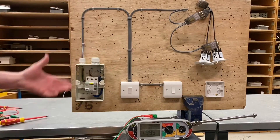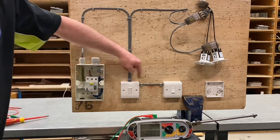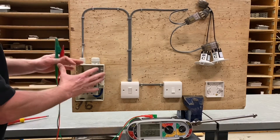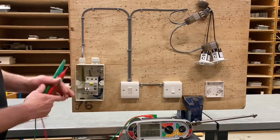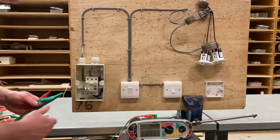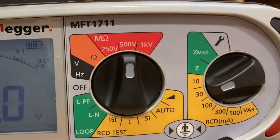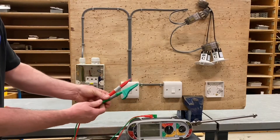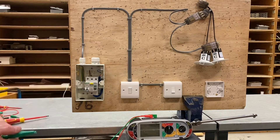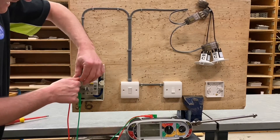We don't know whether the switches are on or off, so presume they're in an unknown state. For AM2 or AM2S assessments, the preferred method is to perform the insulation resistance test once, operate one switch and test again, then operate the other switch and test a third time — effectively doing the test three times to cover all switch positions, as per the on-site guide guidance notes. Let's set the instrument to the red scale at 500 volts DC. I still have my probes in and I also have a crocodile clip ready.